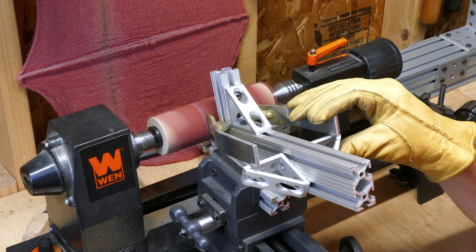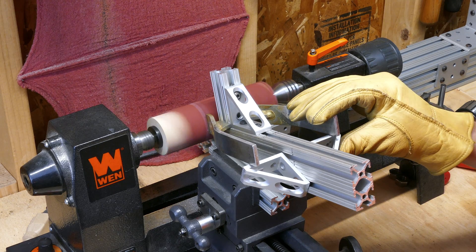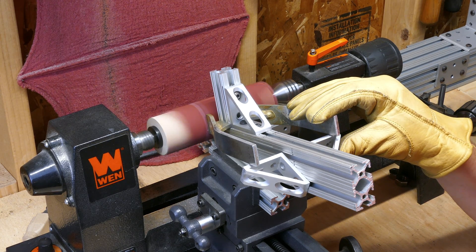I did a summer internship at 3M several years ago, and one of the coolest parts was that every week I got to spend an afternoon touring a different project area. The week I went to the abrasives division, the 3M guy grabbed a 1-inch solid rod of 4140, loaded it into a robotic arm, which then held the bar against a spinning Cubitron belt. The robot ground about an inch of the bar off in less than 30 seconds, shooting a steady stream of sparks. Then the arm returned and the 3M guy handed it to me — it was only mildly warm on the ground end. Pretty crazy stuff. Of course I have no idea what the optimal speed and pressure is for this job, but I do know the Cubitron II handled the thick yoke plates much better than the emery cloth ever did.